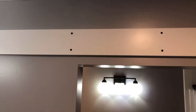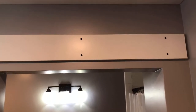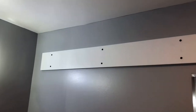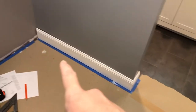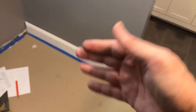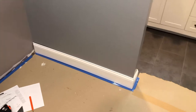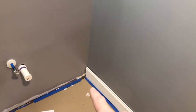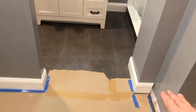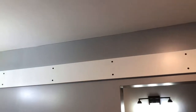Now I'm ready to put my rail up, so I'll go ahead and measure for my rail — it should be just about in the center of that board. I'm going to double check and measure the height where the rail is supposed to be. As the instructions will state, you'll want to measure from the highest point of your floor so your door doesn't get too low and hit the floor at any point. Mine's fairly level so it should be good, though the floor does sink down a little bit over there — I'm measuring from the higher most level point.